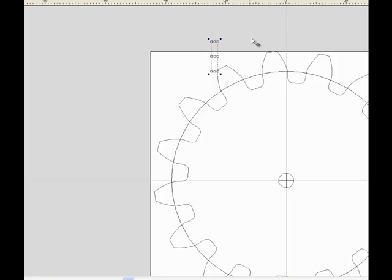So if you find this happening to you, look very carefully to make sure that you have specified the correct diameter gear, you have cut a blank of the right size, and you have zeroed the tool at the correct position, which is the point where my mouse is pointing right now, the very dead top center of the gear, as we'll see in examples coming up very shortly.